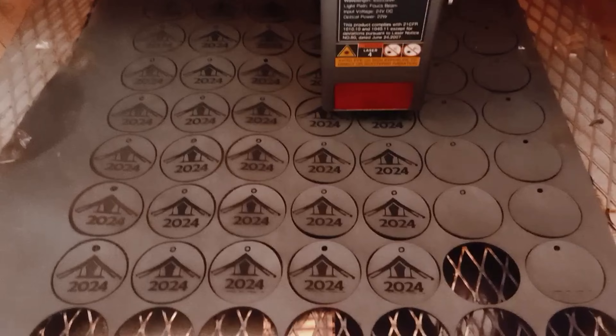The laser head is going to cover the whole work area, so next we'll start engraving. Remember: if you're engraving and cutting, the best practice is to engrave first and cut later. If you cut first, the pieces can pop up and then the engraving may be inaccurate or not come out the way you want. So I like to engrave all the patterns first, then finish by cutting the outline.